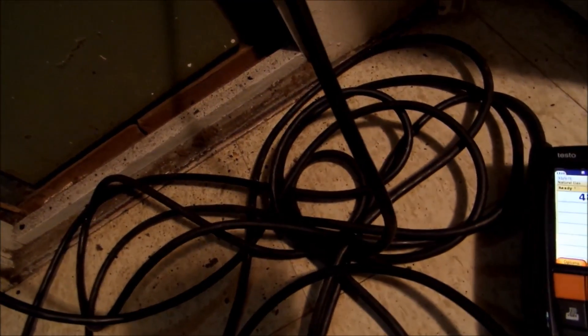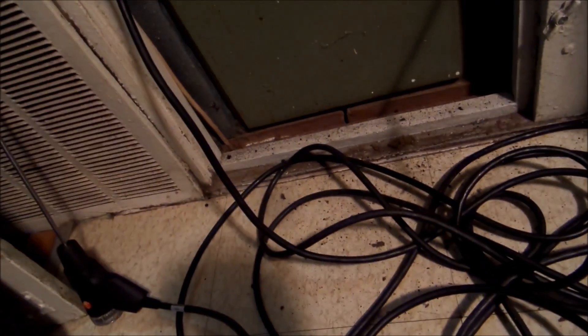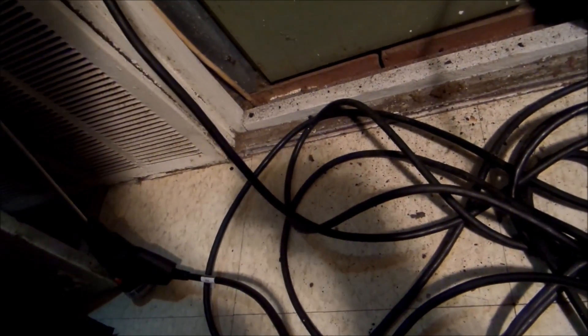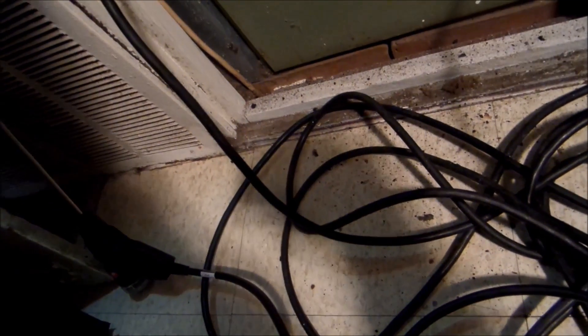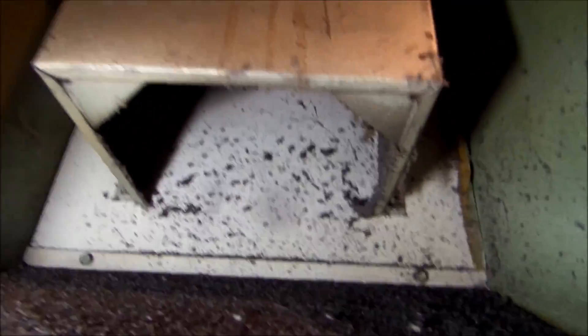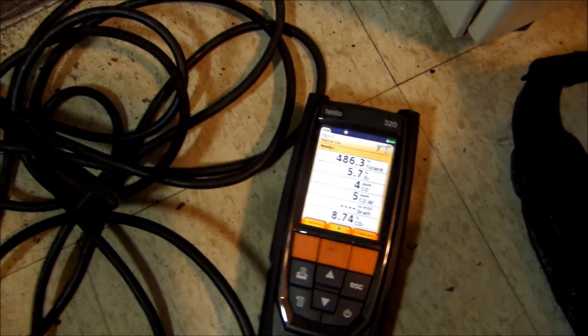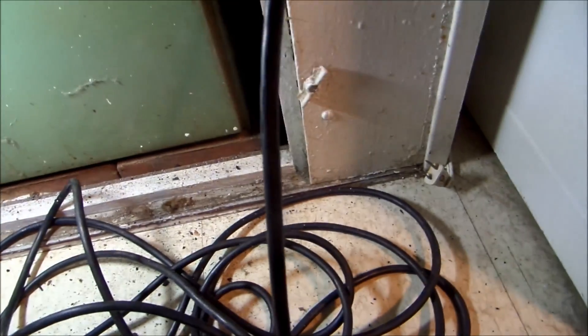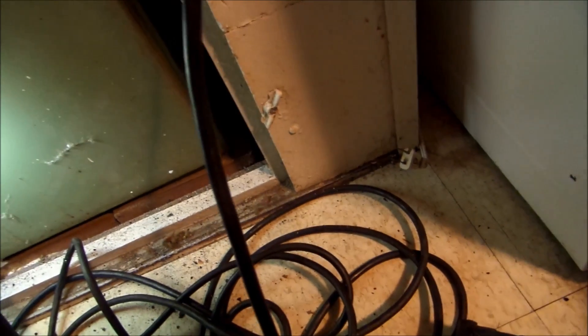It's working the way it should now. What was wrong? It had a bad gas valve. I blew all the pilot assembly out with my compressor. See how the flames come in on that thermocouple — you're gonna be okay now. The carbon monoxide levels is what I was concerned about. Are the carbon monoxide levels okay? Yeah, it's four parts per million. It was over 3,000 parts per million of carbon monoxide in this house. Now it's only four. Good thing we changed that gas valve — it's all set now.